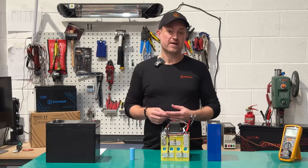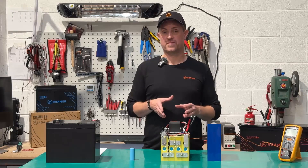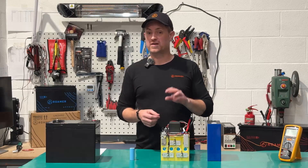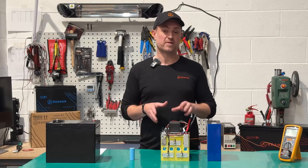The heating film around the outside of the battery only warms the surface while the interior remains cold. These temperature gradients inside the cells lead to non-uniform ion movement that causes lithium plating, which will permanently damage your battery.